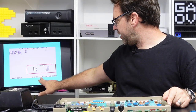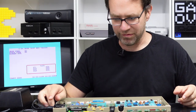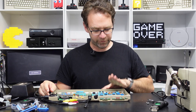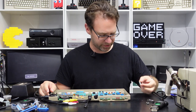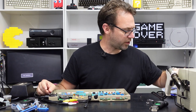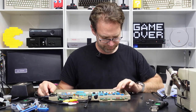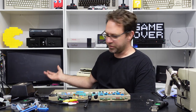The same applies with the CIA chip in U1. There we go — 11 AM, and this one says 60 00 00 AM, so it's still wrong. If we put the working one back in, everything goes back to normal. Now the dead test won't tell you everything and it doesn't fully test the RAM, but generally it'll find a fault if there is one with a RAM chip. So I'm going to remove the RAM in U21 and put in one that I know doesn't work.